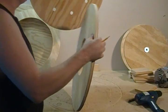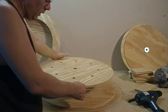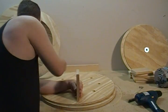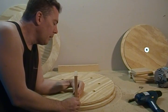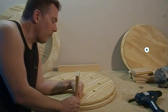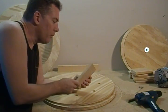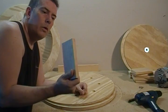That just ensures that we have alignment top to bottom on our rings. In the next segment, we're going to square up and glue these struts down before we put the screws in. The reason we're going to do that is because if you just put the screws in, it's not going to keep everything nice and square. So we're going to go for a little more precision on that. Drill out your holes and transfer them through — remember to put a pencil mark to clock your piece, and we'll see you in the next segment.